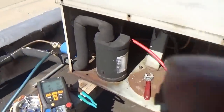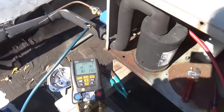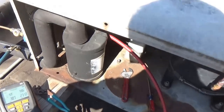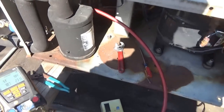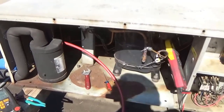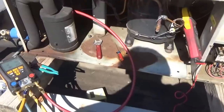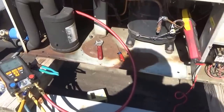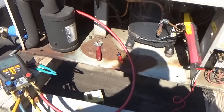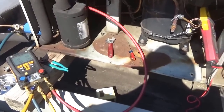So far all I see is the head pressure is high. I'm going to get my CO2 tank and try to blow the condenser out to see if that was it — it might be plugged up. It looks clean on the surface because the rain washed it off, but it might be dust inside there plugging it up. It's the end of the summer. Let me go get my CO2 tank and give that a try.